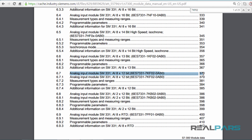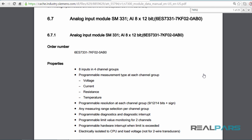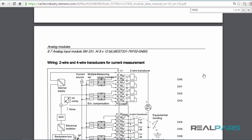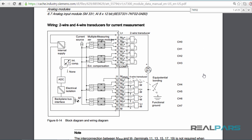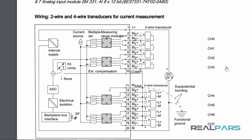Here in the table of contents it says I should go to this page for more info. By clicking here it takes me to the exact page I want. As I mentioned, the sensor that I'm wiring to this module is a 2-wire transmitter, so I'll scroll down a bit — and here is the wiring diagram that I'm looking for. As you can see, to turn on this module I need to wire positive 24 volts DC to terminal number 1 of the front connector.